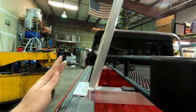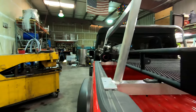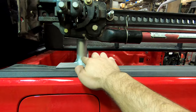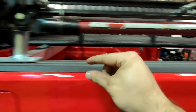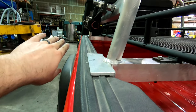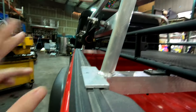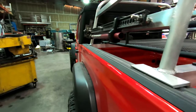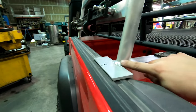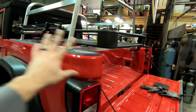The way I built this, the uprights — everything is inside the bed line, as you can see. Odds are you're going to smash up your bed before that anyways. But I also had a thought — maybe taking another piece of tube coming out like this, just sticking out just past the body up here a little bit and bringing it back in. So that way, if it sticks out just a little bit past the body and you get off-camber against a tree or something, that tube is going to take the impact. I'd really have to think about gusseting it because aluminum might want to crack, but I think it might hold up because if it's connected with this tube, it's braced all the way to the other side of the bed, so the load would be dispersed across a larger section.